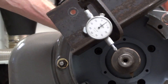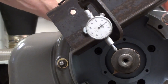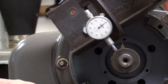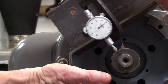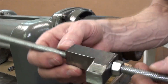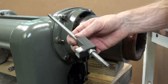When I was testing the motor before disassembling, the rotor was rubbing on the stator. I wanted to take one last check of the runout on the spindle. The spindle is really good, and I think what happened when the machine took a fall, the stator got bent a little bit. When we put the stator on we may have to make some adjustments to how it fits so it'll be centered about the spindle. I'm going to use this gear puller that I use for removing the rotor to temporarily hold the stator in place while we take some measurements on the spindle.